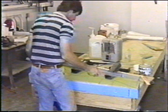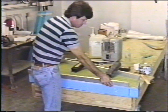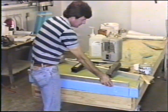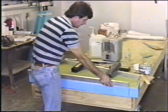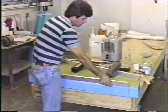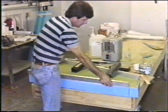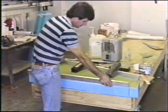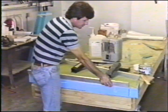We're going to be a little more forward of the trailing edge, and when they went to pop their extrusions off, they pulled glass from foam, and it showed up later on. We're, as I mentioned, bonding only in the area where it will be glass to glass. You can see the Dacron through the surface. You can tell where that glass to glass area will be. When we flip this over, we'll show you what that is supposed to look like.